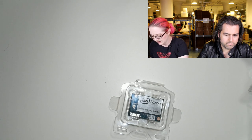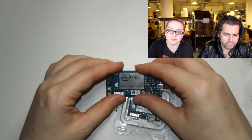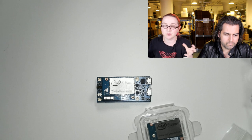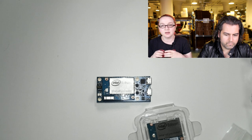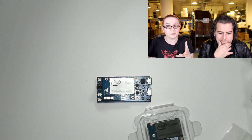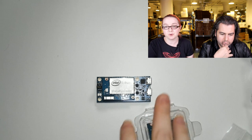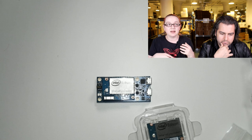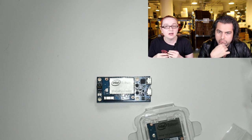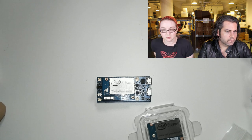It has flash on board, so it's an all-in-one, and it's meant for, let's say you're doing a robot and you want to be very small. You don't want to have a full Raspberry Pi or a full BeagleBone on it. Teeny little board. You want to have wearables. Maybe you want to have a quadcopter and you want to have a lot of processing power on it. This would be a really good match for a project like that because it's very powerful and it's running Linux, but it also has this small form factor. It has wireless capability built in, but it's easy to use because it has Arduino IDE that you can use with it.